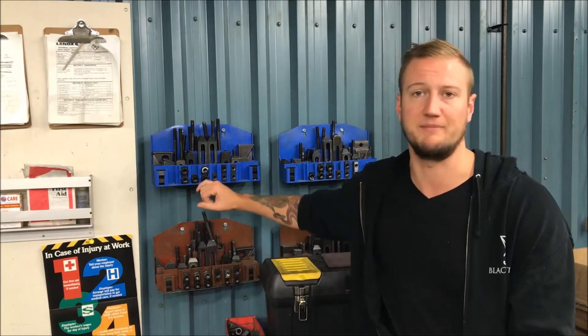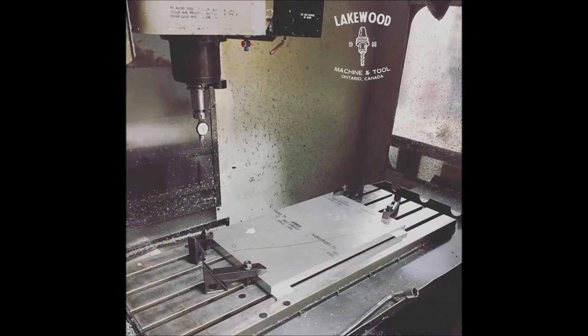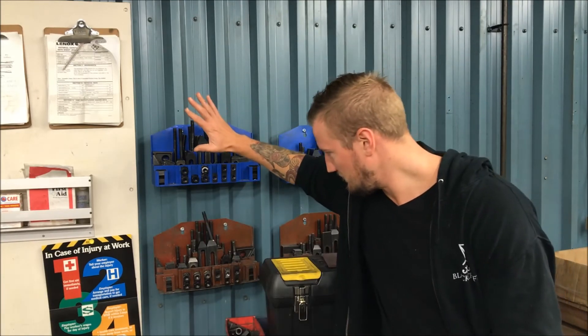The good times to use T-nuts and clamps are big plates. I'm holding down fixturing plates — if I make a fixturing plate where I can screw parts down into it, I can always use this to hold it down. That being said, I'd much rather just bolt it straight to the table. These are kind of your last attack. Always try to start yourself at the vise and work yourself up that way.